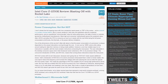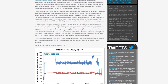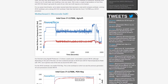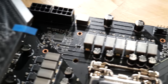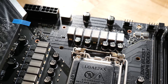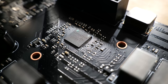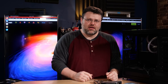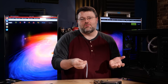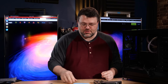Now let's talk power delivery and power phases. The i9, if you unlock it, can push 400 watts through that CPU to the socket — it's pretty nuts. The MSI implementation here is a 16+1+1 configuration, at least as MSI refers to it, with 75-amp power stages controlled by an ISL69269, which is the same controller many other manufacturers have opted for. It does make a difference with Rocket Lake — it's really about what it's able to sustain — using it in a non-stock, quasi-multi-core-enhancement configuration sanctioned by Intel.